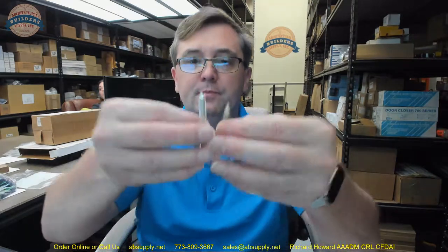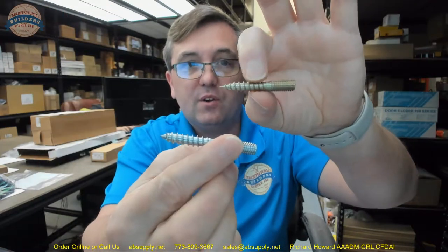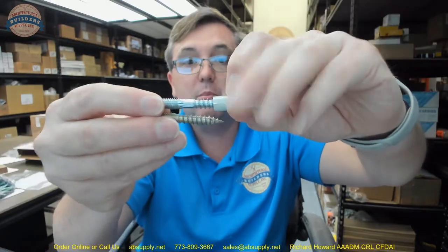The fasteners — let's take a closer look at that. This will come with a hanger bolt. I am going to include a couple of hanger bolts actually. The difference between the two is the length, but specification-wise they are the same. They thread into the base. I would guess that the longer unit is going to be used for an application where you would be using this plastic anchor, and the shorter one would be for a wood application.